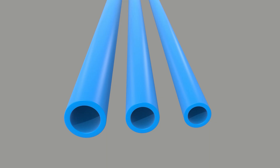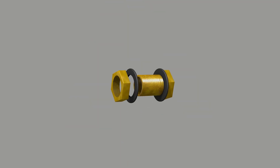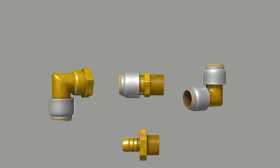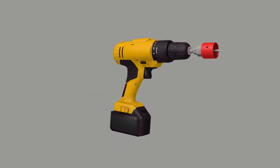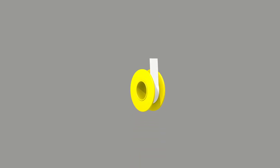In most cases, you'll work with one inch, three-quarters inch, or half-inch pipes. For this job, we'll be using three-quarters inch pipe. So here's what we need: three three-quarters inch tank outlets, one three-quarters inch gate valve, three-quarters inch connectors, and three-quarters inch pipe. Notice that we're using three-quarters inch consistently across all components — this avoids misfits and ensures everything connects properly. We'll also need a drill with a hole saw, a plumbing wrench, and some Teflon tape.